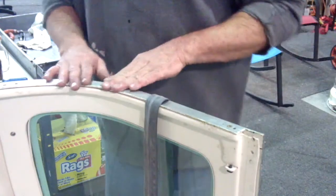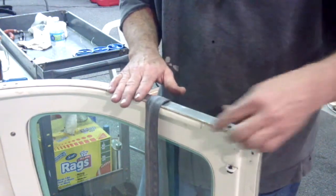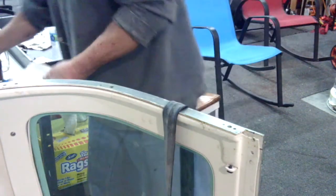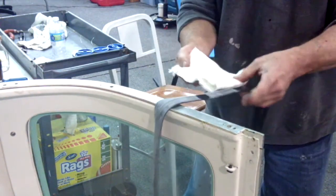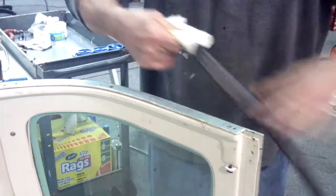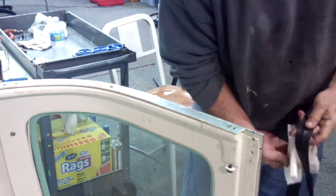We've cleaned it all down. The trick is just giving xylene enough time to work — three to five minutes. The last little bit soaked in so much I was just able to take my thumb and rub it all off. Now we want to take all the talcum powder off of the new canopy seal. To do that, we're using rubbing alcohol — just taking a white shop rag, pouring on some alcohol, enough to go on both sides. Pull it along one way, then turn it over and go one more time. Lay that aside to dry, then check it all one more time.